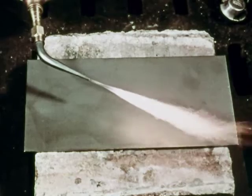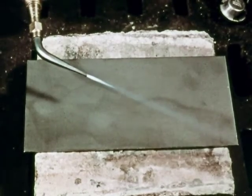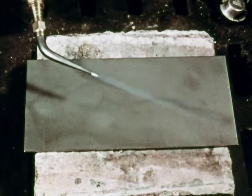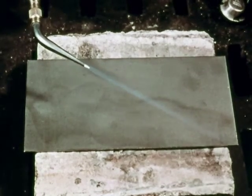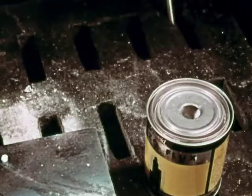We'll do this by depositing bronze on a flat plate which first has been made mechanically clean by scrubbing with steel wool or a wire brush. To make the metal chemically clean, we'll use a braze welding flux on the rod.